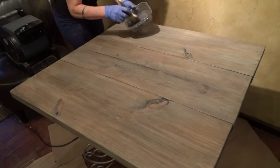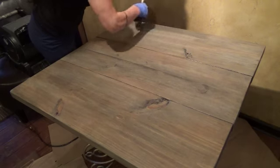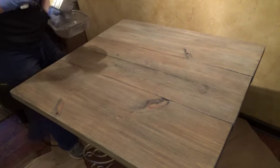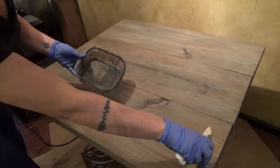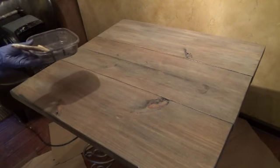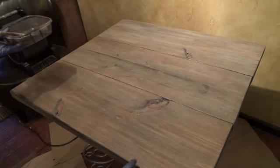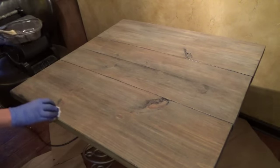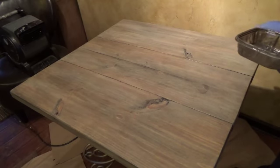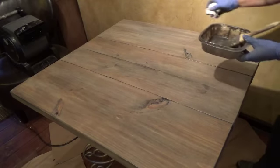That was enough — just a few minutes — and now I'm going to add more to the two areas that are just a little too light for my taste. I'm using the side of my brush, angling it and just getting the dark color, leaving it on the edge — swiping under so it's not drippy, and slightly over, leaving this color on the edge. It's grabbing nicely because that's really where I sanded the edge smooth.